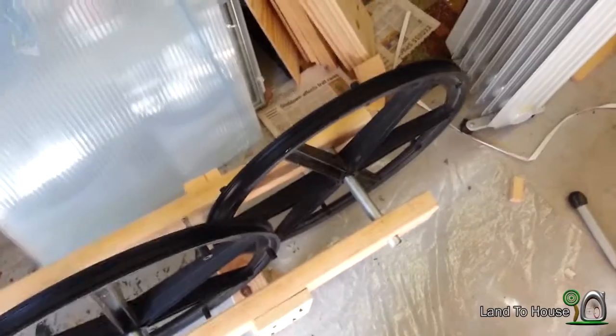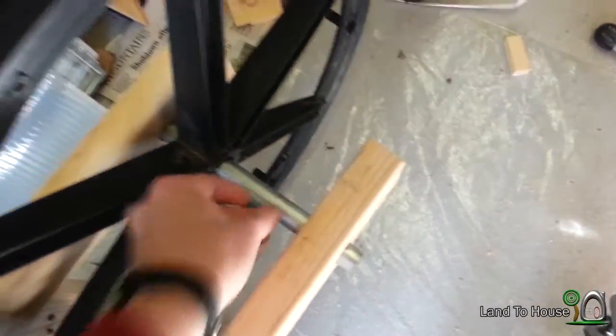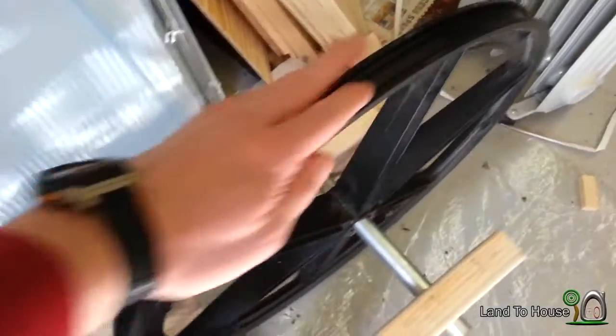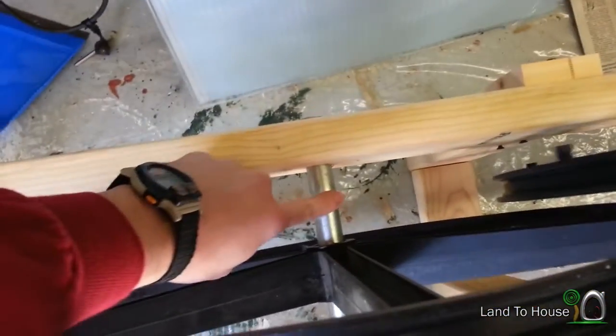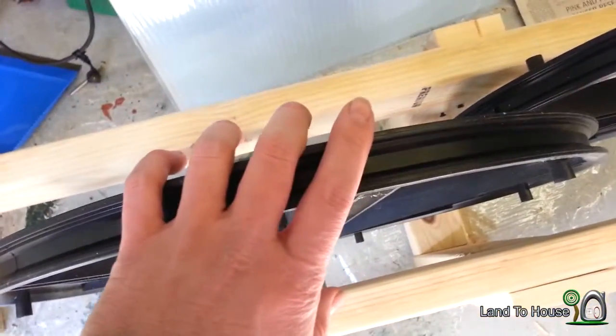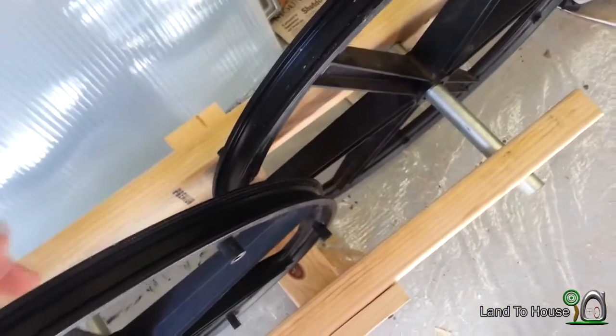I have two wheels placed on here now. This one on the back will be where I actually spin myself. I'll put some set screws in here so that the bar moves with the wheel and it won't wobble. This wheel will drive a pulley attached here to a small wheel, and that will turn the big one faster. I think this is a 20 inch wheel down to a 2 inch wheel, so it'll be a 10 to 1 kind of deal.